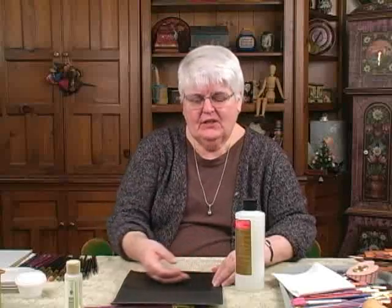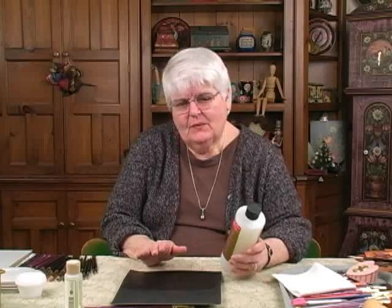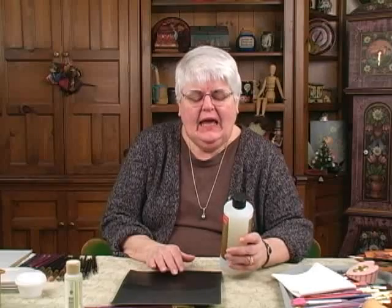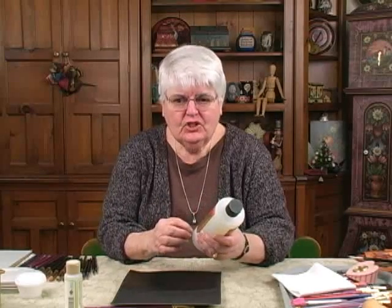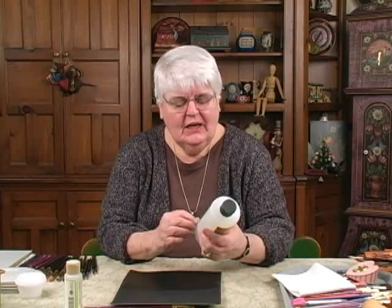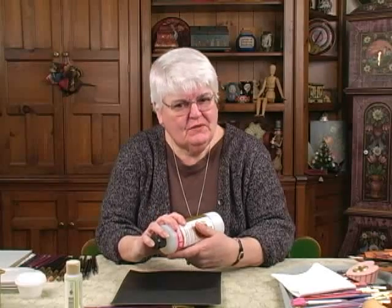When we speak of white streaks, you're putting your varnish on and where there may be a ridge, you're getting a white streak. The white streak is coming from the matting agent that's in the varnish. And if you have not been careful shaking your varnish before using it, eventually you get a higher percentage of matting agent in the bottom, and sometimes that becomes very firm.